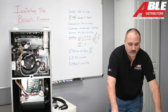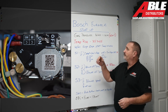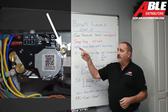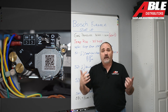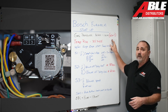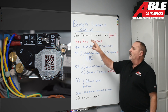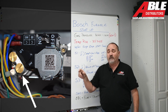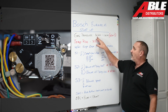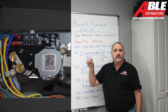Let's get into the startup procedure. What you're looking at here is the gas valve. You want to check gas pressure — the first port highlighted is the inlet pressure port, which is the pressure from the gas company. You need a minimum of 4.5 inches of water column. Most of the time it's going to be 7 or 8; 4.5 is pretty low, and when it gets down there something else is going on — not a big enough gas pipe or pressure issue. The outlet pressure of the gas valve should be 3.5 inches of water column on high and 1.6 on low. Remove the brass caps and there are adjustment screws inside to set those.